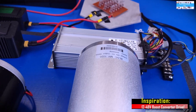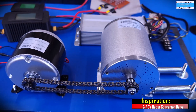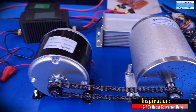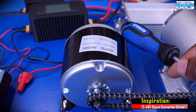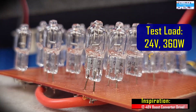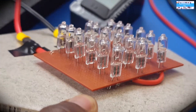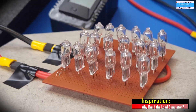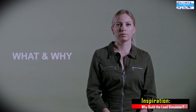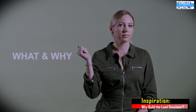The concept of what we're doing here is really very simple. We have a DC electric motor that we're trying to test and a second permanent magnet DC electric motor that we're going to use as our DC generator. When we apply a load at the output of that generator, we look at the performance of the e-bike electric motor driving that load. The question is: what do we stand to gain, what data points are we looking for, and why not just build an e-bike?